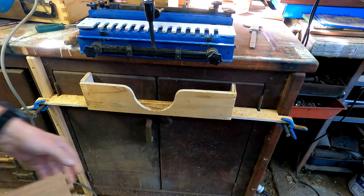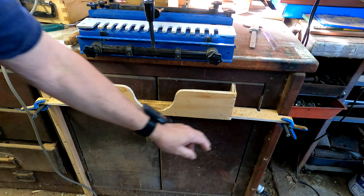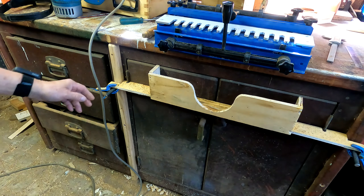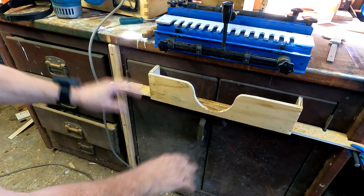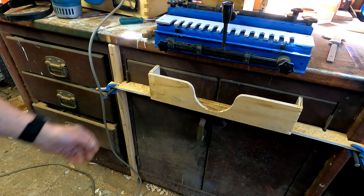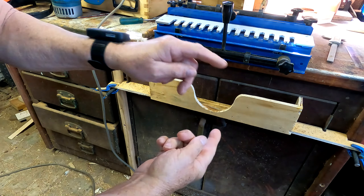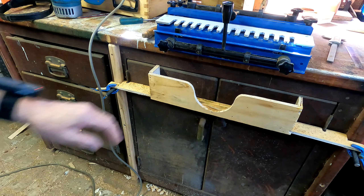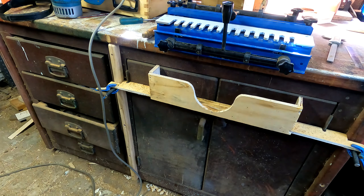That's what happens if you don't have a support, so I made one up — that's it, bang, first thing done. That saves your job. I've got these pegs with different holes at different lengths for making boxes of various sizes, so the wood can sit down and when you loosen it and it falls, it's not going to hit the ground. It probably only drops a small amount — you could put a bit of sponge in there, or sawdust and shavings will work just as well. That's a very useful thing to have — that's the first tip.